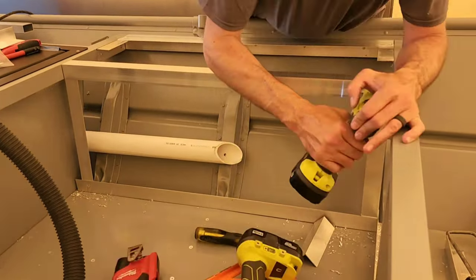With the turf in from Southern Cooler and Marine, there was two things left to do before I can install it. Number one, I had to lay the turf out in the boat, figure out where the turf breaks would fall, and then tape those areas off and paint with black paint. Raw aluminum reflecting through the turf breaks on a black sea deck job would not look like a professionally finished product. Number two, I'd need to tape off all the deck edges and then run a bead of black silicone along all the edges to prevent water from penetrating the deck surrounds. We would prefer to control where the water is routed and don't want it slipping past the edges of the deck. With these two things done, I could then install all 33 pieces of custom sea deck.